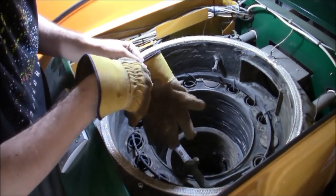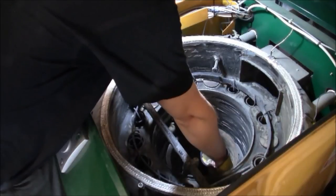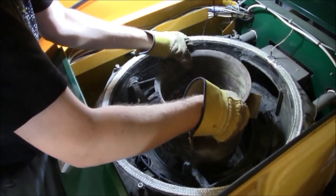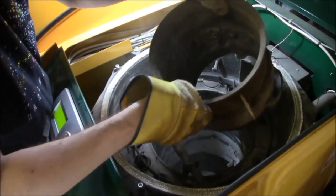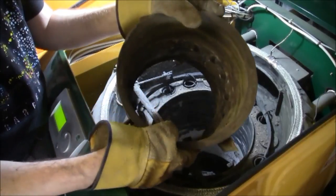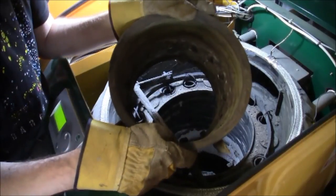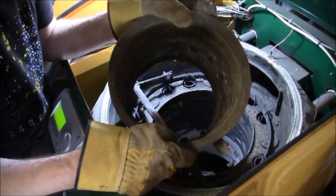We've cleaned up a little bit — let's see if we can remove this burn can. It just lifts out; it's not attached in any respect, it's held in place by gravity. Maneuver it past this mechanism. There you go — a shower of dust. And there you can see the burn can itself. Look closely: you can see little jets inside, like a jet aircraft afterburner. That blows extra air into the exhaust stream, ensuring full combustion of all the fuel.